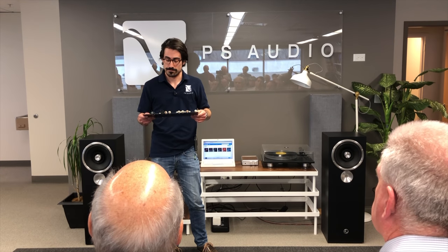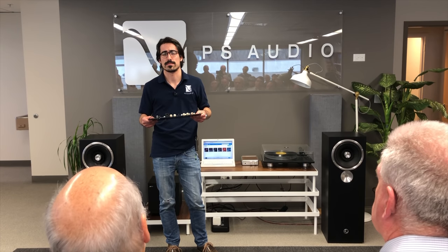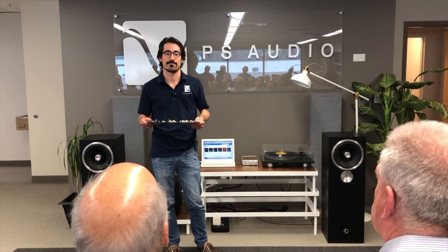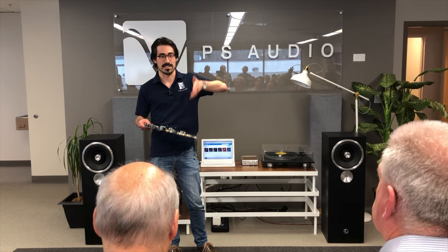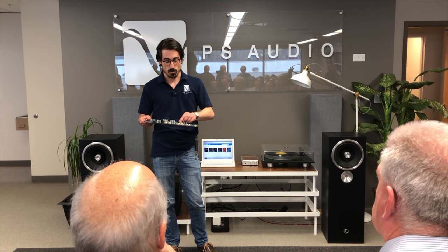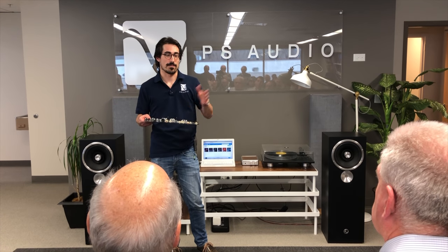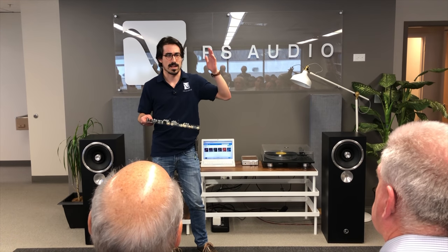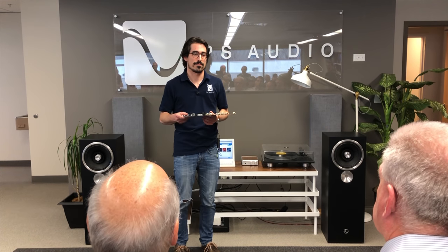What sort of rails are you running? Plus minus 27 volts. So you've got lots of dynamic range. Yep, it's one of the keys. Because the surface noise and pops can really swing, especially on the input stage of a moving magnet, before the actual EQ rolls off the top end. It's very demanding in the upper ranges. By 20 kilohertz you don't have much musical information, but by 10 kilohertz or 8, it's very demanding on an amp. Any other questions?